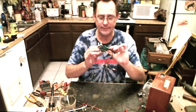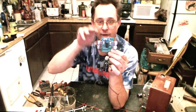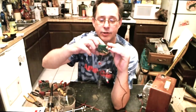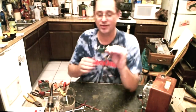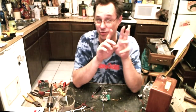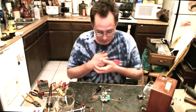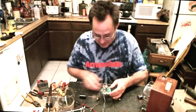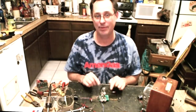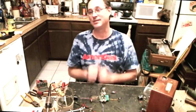This NAND Synth has a master power switch, then two switches that affect the way the oscillators feed each other or go direct out. There's four pots — one is volume and the other three affect the oscillations. It's a single chip, like five or six resistors and five or six capacitors. Four of those capacitors are real small, right near the chip, and those affect the oscillations — you could put those on switches with small and large values. I wanted to keep this simple and only did a couple mods. The PCB is so well labeled that every single thing is documented on there. All you need is the part list — you can build this without looking at anything. Hats off to Synthrotec for doing their homework.